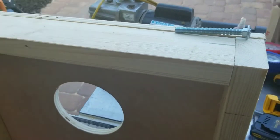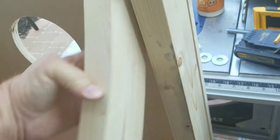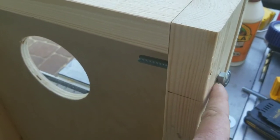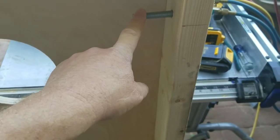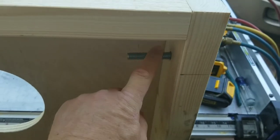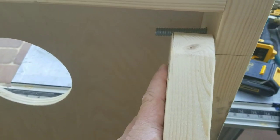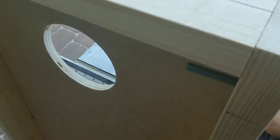The glue is set — it's the next day. The leg pieces are cut and they fold right up into the frame. Here's the hardware we're using: carriage bolts, which go in flush once the nut draws the square shoulder through the wood, providing clamping force. These are 7/16ths — the plans I saw called for 3/8ths but I felt better about this size. They're about four inches long — basically two two-by-fours plus a little extra. On the outside end we're using a flat washer and a nut.